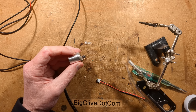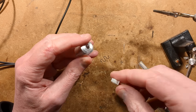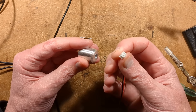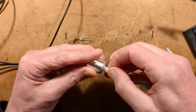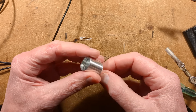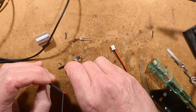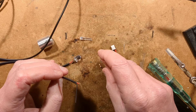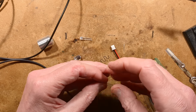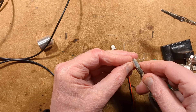I've decided to go a different direction with this. I've drilled the back of this out to 6.5 millimetres — that's roughly just over a quarter of an inch — and it's enough that this little standard connector here can friction fit into it. That means I can just plug an LED of my choice in there, and it means you can change the LED should it degrade. I'm going to run this off 5 volts with a 120 ohm resistor, which should come to around 15 milliamps with a standard 5 volt supply and a typical gallium nitride LED.